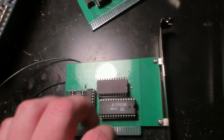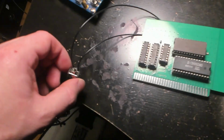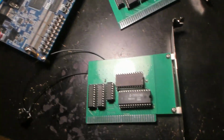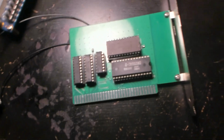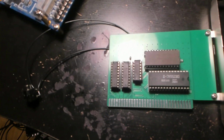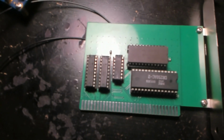Originally I made this sort of simple chip, but this machine doesn't have a PC speaker normally, because I basically hate the PC speaker, but I wanted to run this demo, so I installed this thing here. This plugs in a quite nasty manner to this interval timer channel 2, which is used to generate the PC speaker, but since it's not gated, it requires a little bit more circuitry. The PC speaker sound is slightly buggy, or let's say it mostly sounds okay, but there are a few glitches which are fixed if you have this gate available.